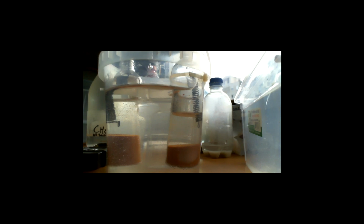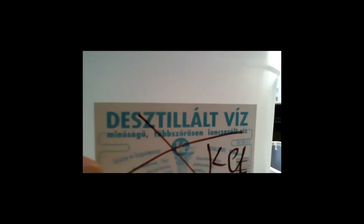Yeah, and there is a fallacy in all this cleaning process, because theoretically it looks like I have shown it to you. Practically, you go down to the purity of the initial cleaning water which you use for purifying. If your distilled water is not a distilled water, if it's not pure, it contains impurities, you cannot go below that. And even the distilled water that you would buy in the store is not really that pure. That's why the labs have what they call double distilled water or even triple distilled water.